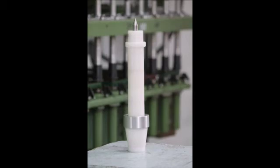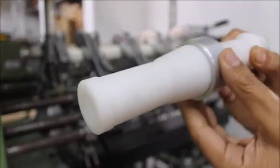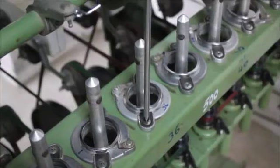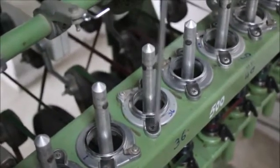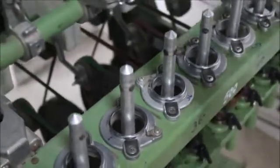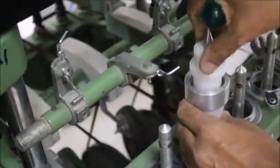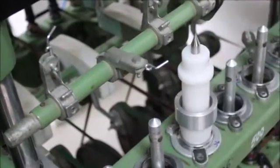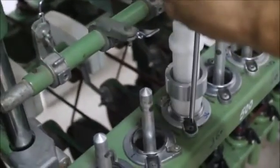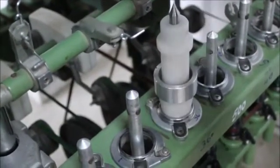We are now introducing the Apex Ring Spindle Concentricity Setting Device. This is the device with the new taper sleeve. The ring adapter screws are loosened and the gauge is now inserted onto the spindle. The tapered sleeve provides positive centering as it engages with the ring.